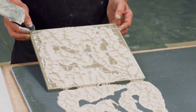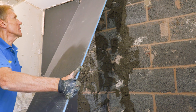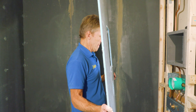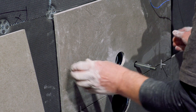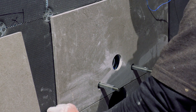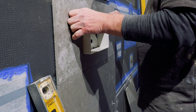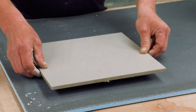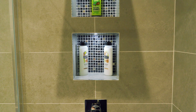There is a difference between what's put down in the standard and what's actually done on site. The ideal solution is to use a tile backer board to get your wall absolutely 100% flat and plumb, so that you can go on with the minimum of adhesive and produce a good contact. Interestingly, it could be argued that by using a tile backer board you're actually saving on adhesive. By using the tile backer board we can actually achieve the British Standard a lot more easily.